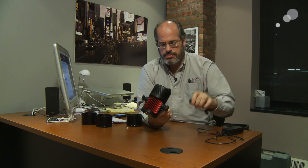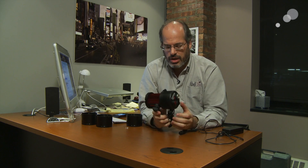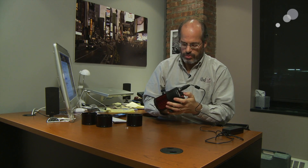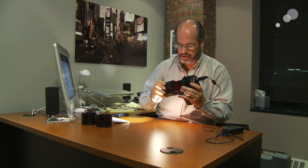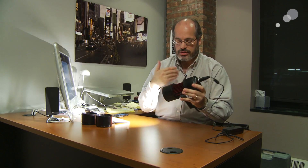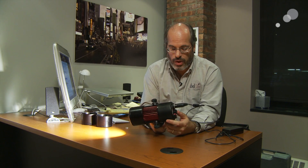It's DC powered — 12 to 36 volt with a regular XLR4 connection. 30 watts, equivalent to 150 watts of tungsten light. Don't let that number fool you because based on its PAR type of light, you actually get very high efficiency out of that. So it's quite a bright, very brilliant light — you get a lot of light for only 30 watts of power.